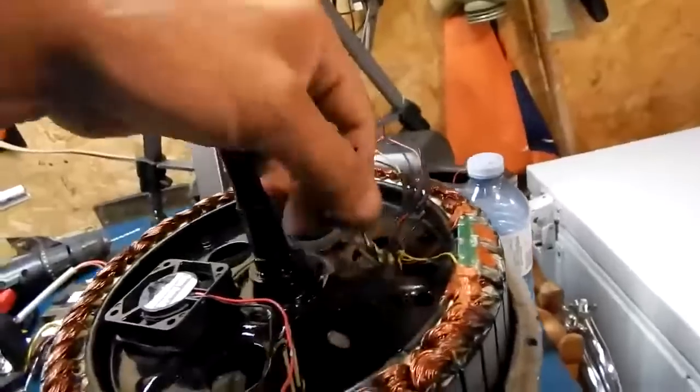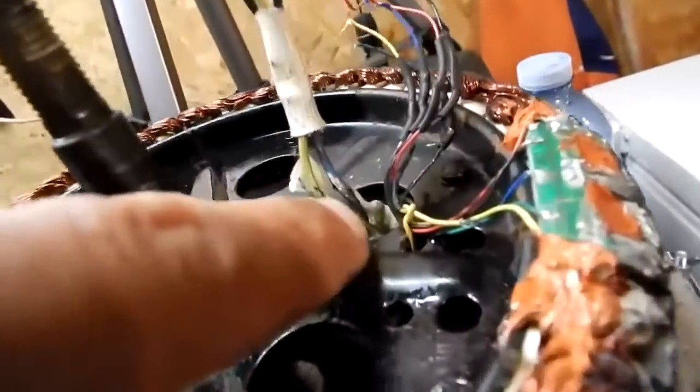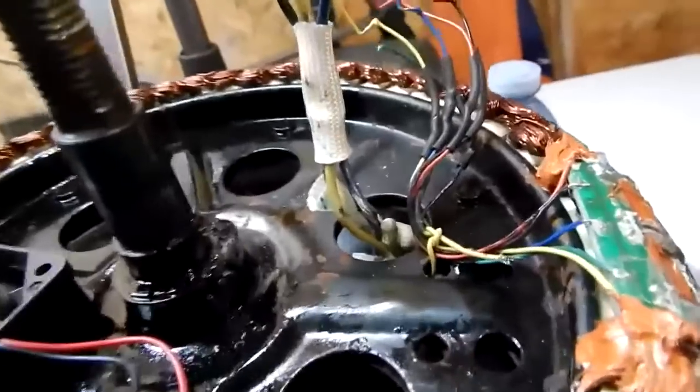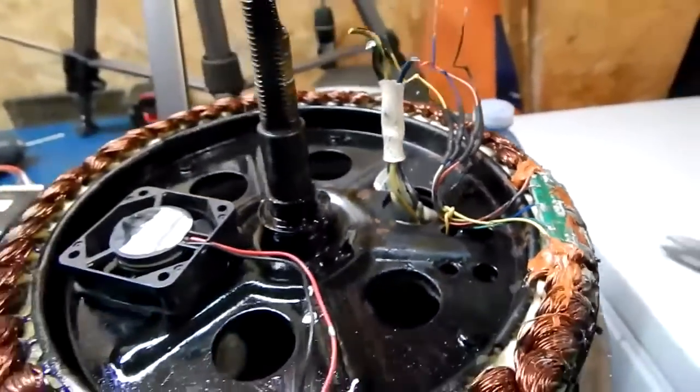What I'm doing now is I pulled all the phase wires out and noticed some problems I've got to address — like right there. There's a bare phase wire that's been rubbing against the case. I'm gonna save myself a blown controller there.